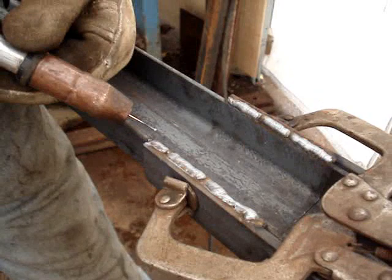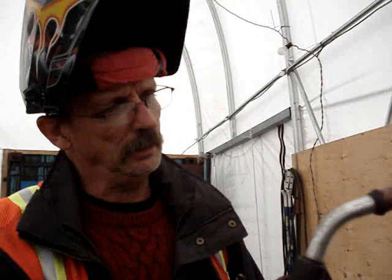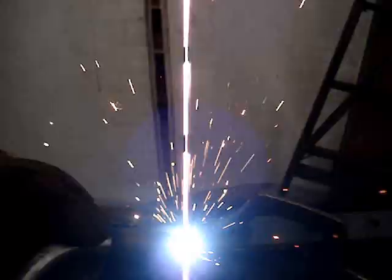Because we're doing a horizontal here, it's fairly easy. If you're doing verticals or sideways along it, you've got to use a little bit of a different pattern in order to keep your bead in an even shape. If you're welding along horizontally, you don't want the bead to slough down out of the weld. You've got to keep it in there — it's got to catch itself. You use a bit of a different pattern to do that.